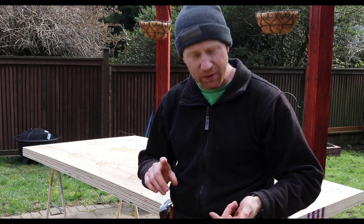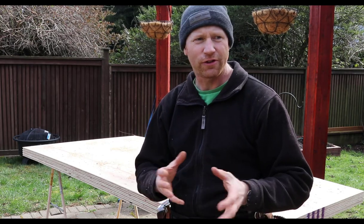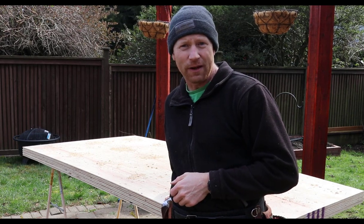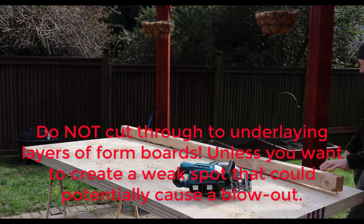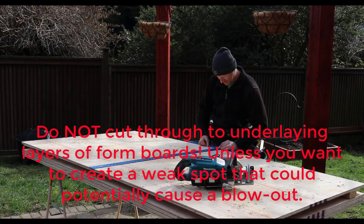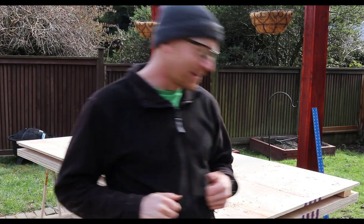For our sample wall here, like I said, we're doing end of wall, inside corner, outside corner, and then just a straight running wall. I'll basically do an eight-foot by four-foot L-shape — that will give us our three features we want to look at plus the straight wall. I'll cut one of these panels into four-foot lengths and then cut some filler strips for both the outside corner and end walls. And in the words of a wise man, I grabbed some safety squints so we're good now.